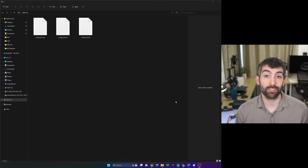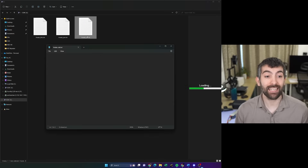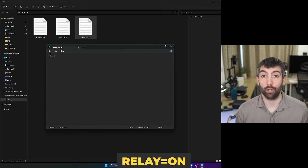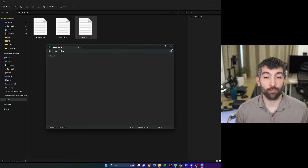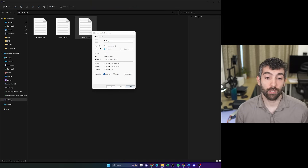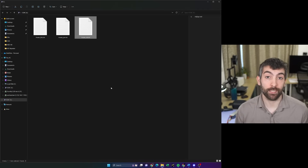After updating the firmware, you'll need to make some changes on the micro SD card you're going to use with your Avatar goggles. You need to create a text file in the root of the SD card called 'avatar_std' and inside that file you need to have a line: relay equals on. Save that file and then importantly make that file read-only so that it doesn't get deleted or overwritten, and that's all you need to do to get the relay working.